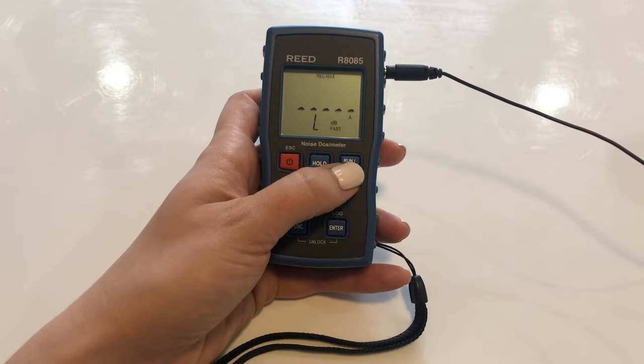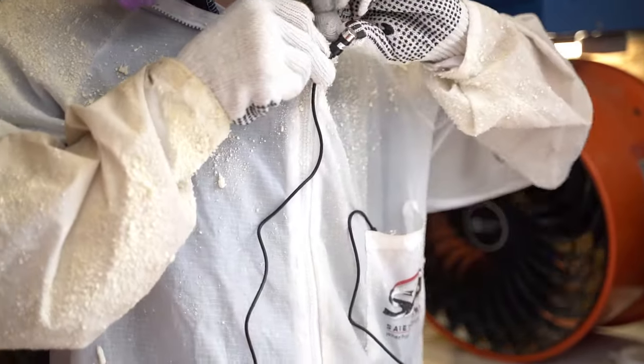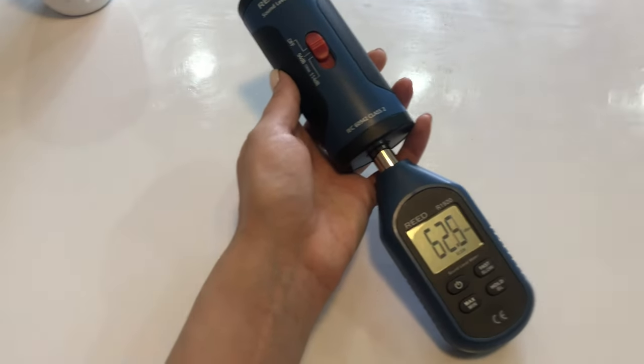A dosimeter is a small noise measuring device that can be worn close to the hearing zone. Some are small and clipped to the collar; this one is a bit larger and can be put in a pocket or clipped to a belt. I chose this one because it has a lavalier mic, which is nice for workers wearing protective suits so the dosimeter doesn't need to be on the collar where it may be damaged by chemicals. Also, remind employees that dosimeters only record noise levels — they can't record what you're saying. As you do noise monitoring, take lots of notes on what's happening operationally, since different machines and tasks can result in different outcomes. Once done, conduct post-use calibration, record the results, and prepare reports for leadership and individual reports for participating employees.